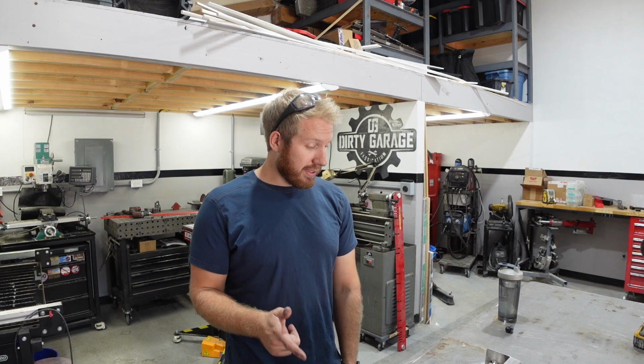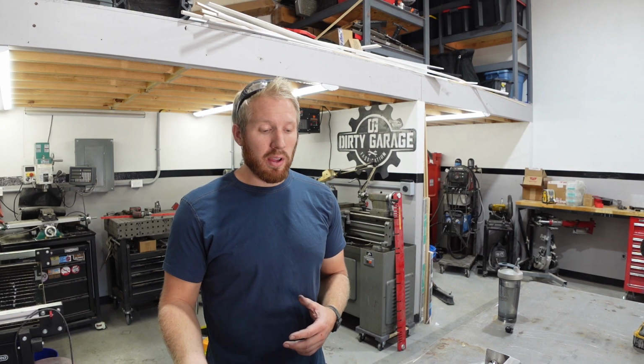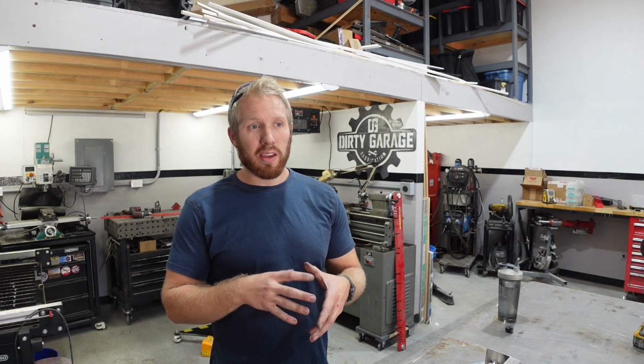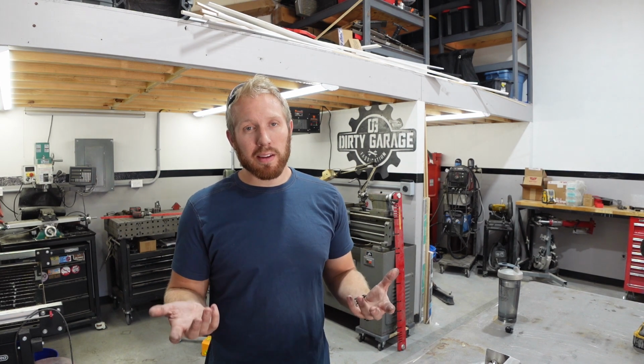Yeah, so some of the stuff that I figured out that I need to work on going forward, obviously a lot of issues with the design portion of it. A lot of that's me just getting familiar with the software. I haven't really done anything with the sheet metal portion of Fusion before, as far as building a 3D model. You're actually making complex shapes in multiple parts, and then you're expanding essentially and unfolding so that you can cut it out in a 2D flat object.